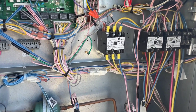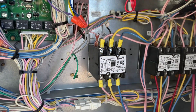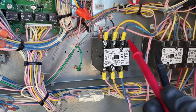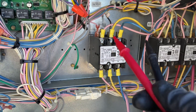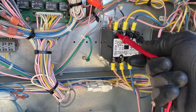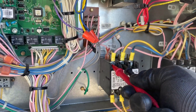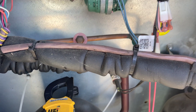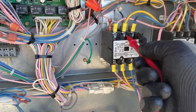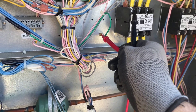I've turned off the power since we are working on the electrical side. Always make sure — even if the disconnect is off — there is no power. Check phase to phase and every phase to ground: L1 to L3, L1 to L2, L2 to L3, and every phase to ground, with one hand.